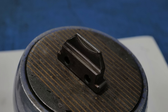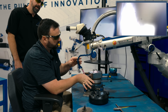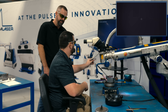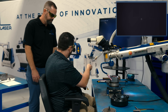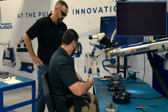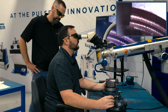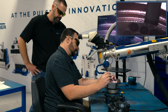Part number one is now complete. Not only is changing the setup of parts very easy, but you can change materials on the laser very quickly too. It doesn't take much to change the settings — just a few pushes of a button. That was P20 mod; now I'm switching over to 420 stainless. All your tool steels, the settings are pretty similar — you don't have to make too many adjustments. So this filler material is 420 stainless. What is the base metal? Also 420.